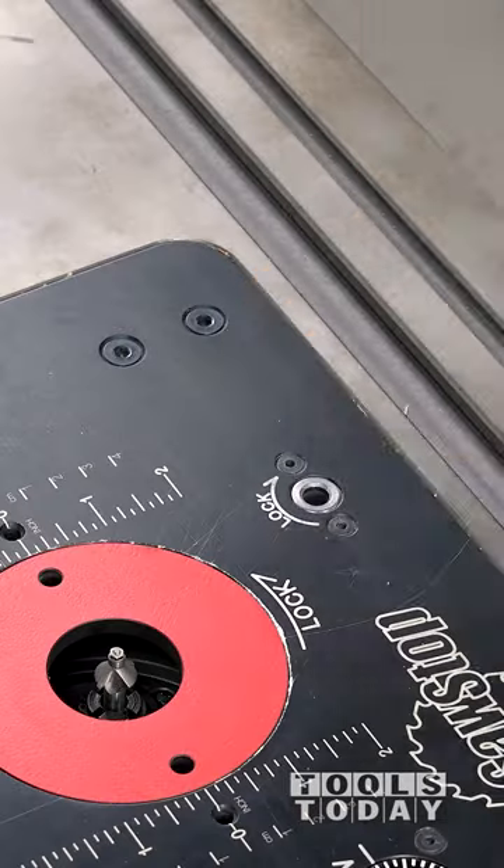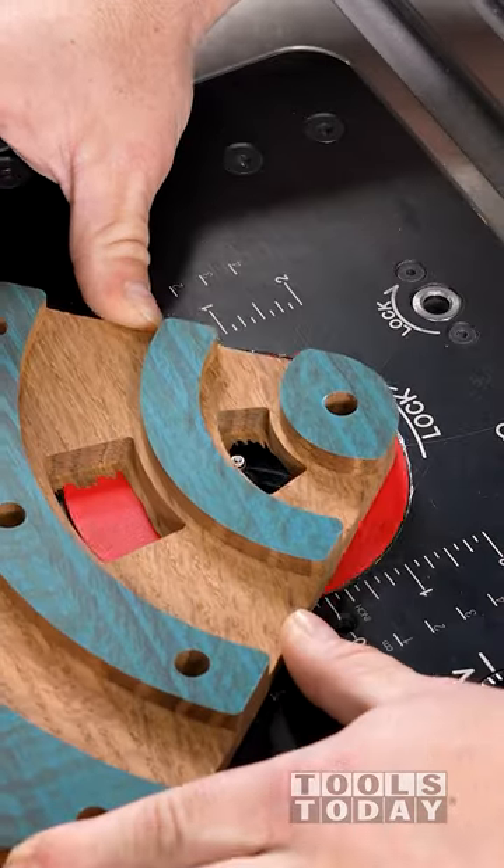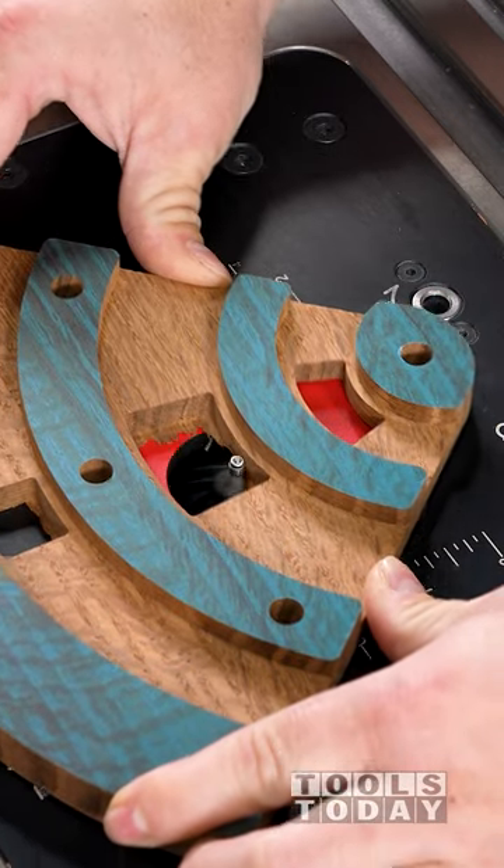The windows also have some skin left that needs to be trimmed away, but I'll use a mini chamfer bit on those. The mini bits have a three-sixteenth-inch radius ball bearing that allows me to get into the corners left by the eighth-inch bit.